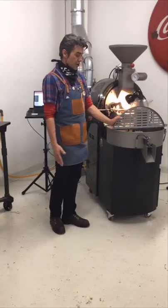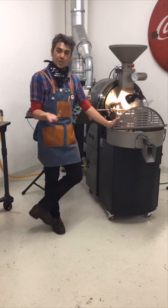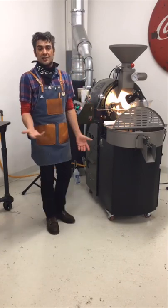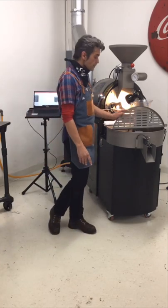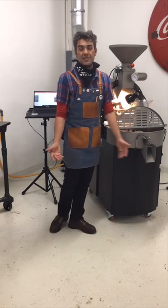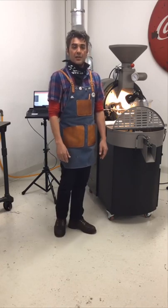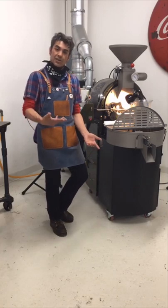Classically, in most of the City machines, we have a roaster cooling tray cover — same deal here, it turns the arms on and off. I like to use it as a switch with my cooling arms on all the time. We also have another little sensor on the cooling tray out chute — as soon as I open that chute it turns the cooling tray arms on, assuming we're trying to get coffee out of the cooling tray. When I close it, they're back off.